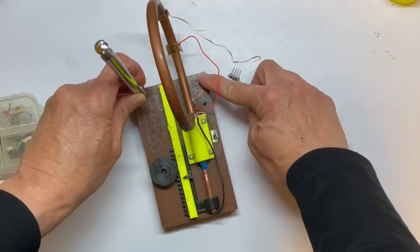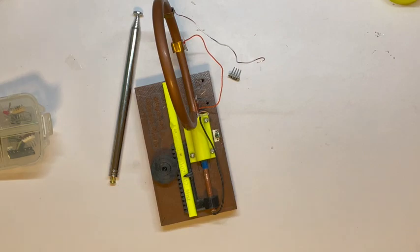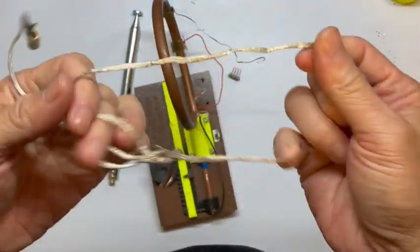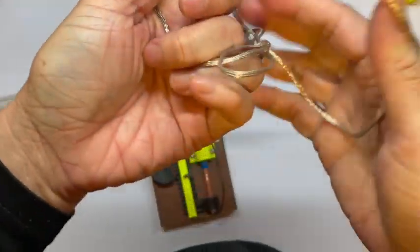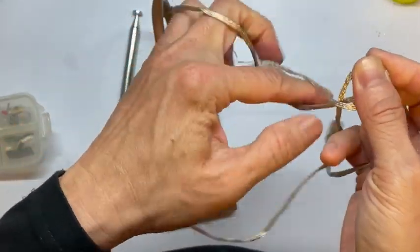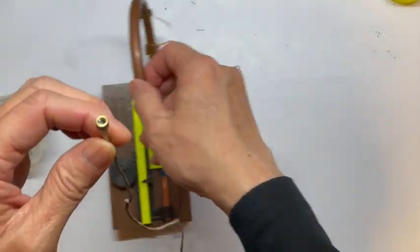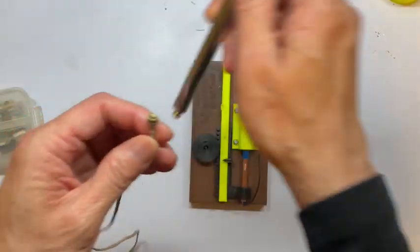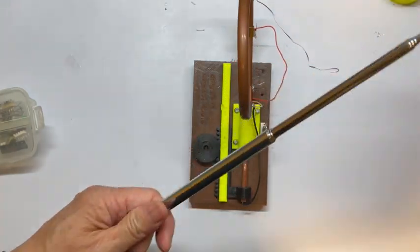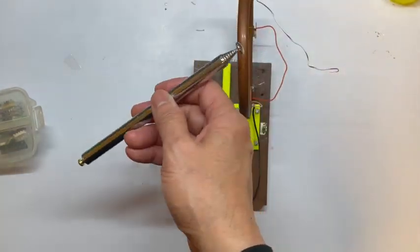The other screw can be mounted here for you to connect a long piece of thread. You can hang it from the crystal radio to create the effect of a dipole — this will be the lower end of the dipole, and you can use the telescopic antenna to be the upper end of the dipole. This will give you much better sensitivity than using just a telescopic antenna.